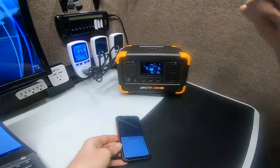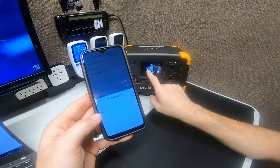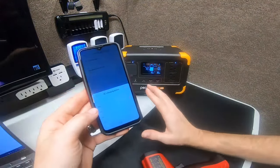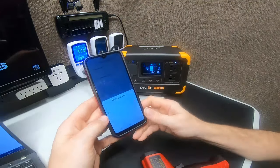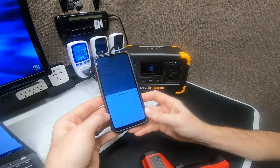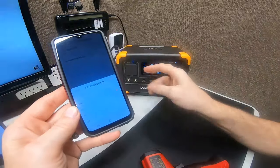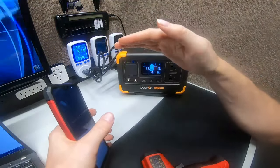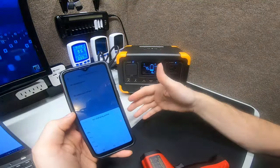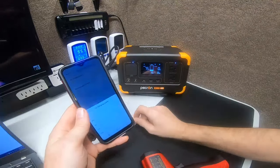At 25% charging power, we're seeing about 75–80 watts input. This is Peckron's answer to Bluetti's turbo/silent/normal modes, but with more incremental levels. Charging slower is really beneficial — the slower you charge when you don't need it, the longer the battery cells last. It's like a V8 engine idling at 50–60 mph versus pushing it to 120–150 — the harder it works, the faster it wears out.